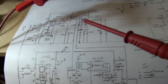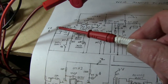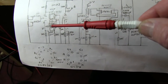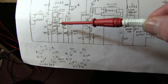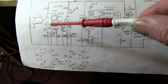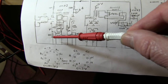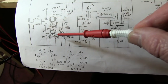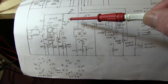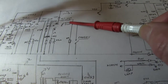On the preamp side, you've got two channels, the Reverb channel is just on channel 1, and channel 2 is just a normal channel that has no reverb. It's a very standard circuit. It's got treble and bass only, a volume. It's all very standard circuit, 1 ECC 83, just for amplification, all very standard, 1K 500K. The output from this section and the other section goes up here and is mixed through two of these resistors, 220K.